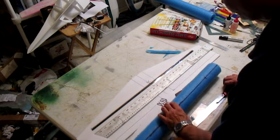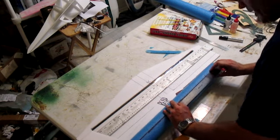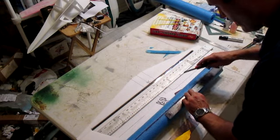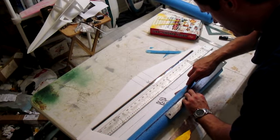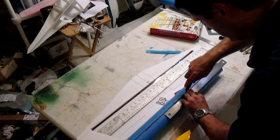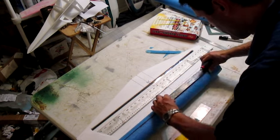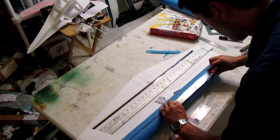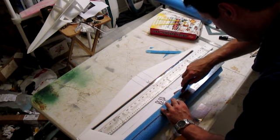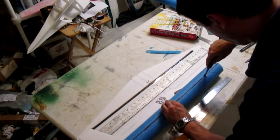This is important. This is the whole kit and caboodle right here. This is the part you got to get right. Okay, this is the part we want to get right. And we just take the razor and we cut straight through the foam, all the way through. Because this is how the wing is going to fit through. Just like that. Straight down that line. There we go.